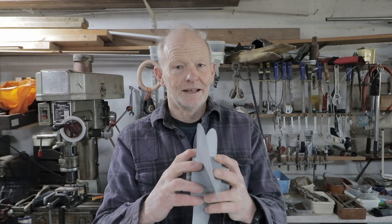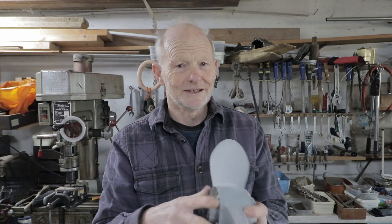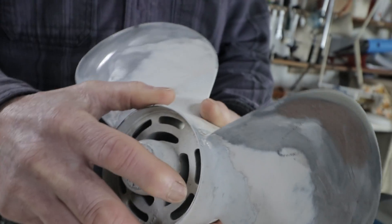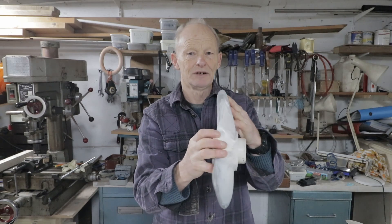The disadvantage showed up in France — with Brexit you have to go into marinas to check in. We got put in a very tight spot with wind blowing us onto the quay. We had to spring off with a spring line but just couldn't get off the quay because the engine going astern wasn't giving enough thrust. When I got back I decided the cup was a bit too extreme. Stage three is to make the cup less extreme but enough to get the drive, while hopefully still giving relatively good astern performance.